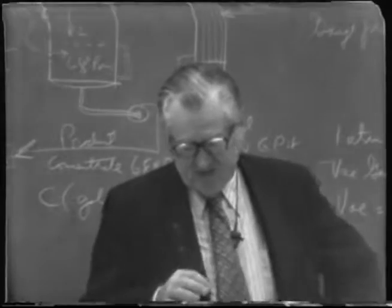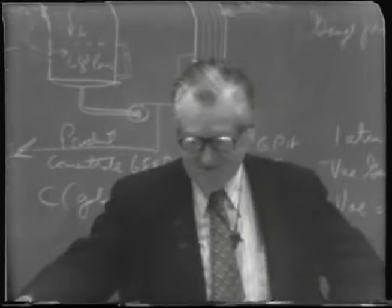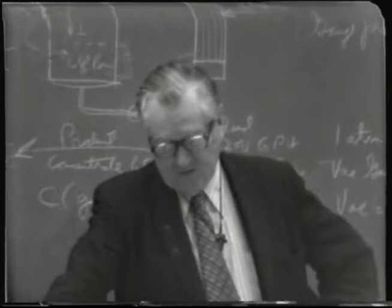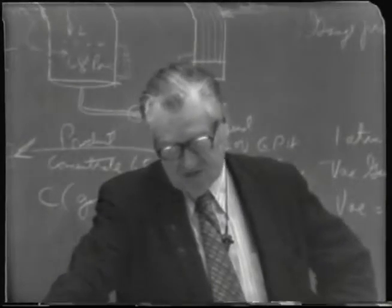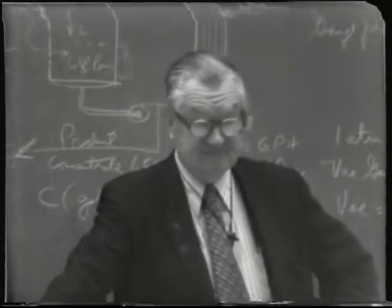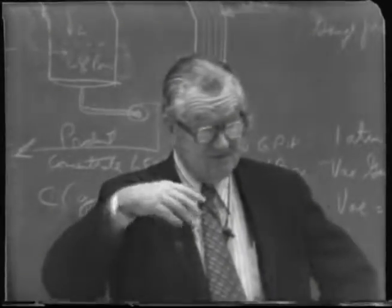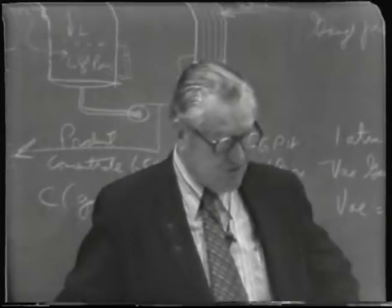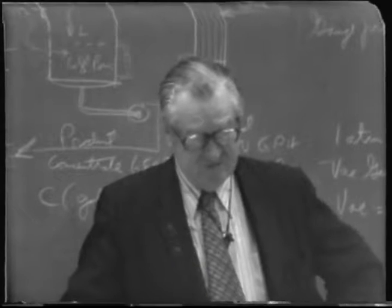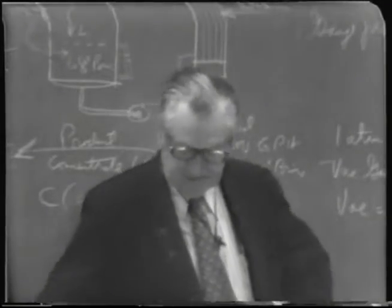In other words, I don't think you'll find this too difficult. Now, the only thing about this particular graph, it may be a little confusing because, just for general information, the equilibrium curve is plotted on a volume percent basis and a mass percent or weight percent basis, as well as mole. So, of course, the volume and weight equilibrium curves you'll ignore. They could just as well not have been on there. Because this McCabe-Thiele method, as you know, has to be worked on a mole basis. Otherwise, our major assumption of equal molal overflow, equal molal heats of vaporization, couldn't be used.